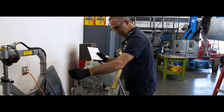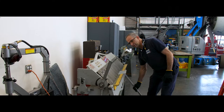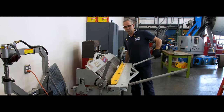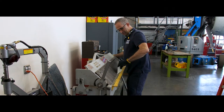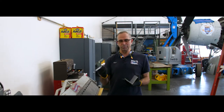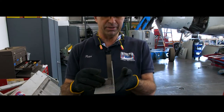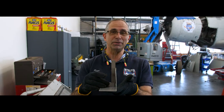What I need to do is open the jaws, put the piece in place, and bring it up to what I approximate will be 90 degrees, then remove it. I have this wonderful little machinist square that I can use to see that I have attained 90 degrees — and I went a little bit beyond 90 degrees there.